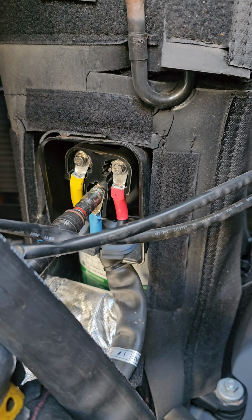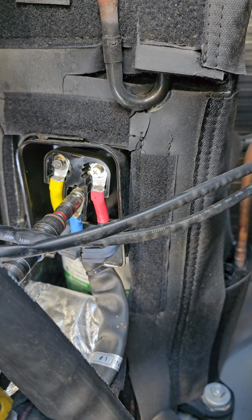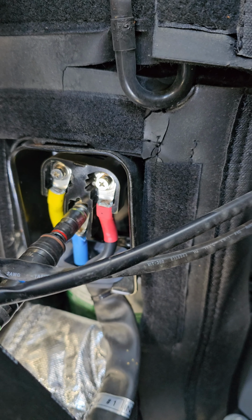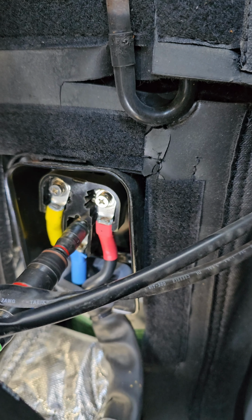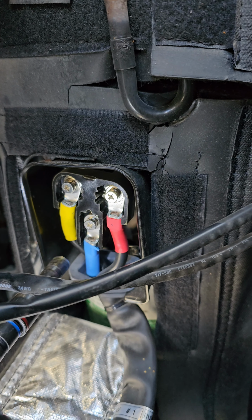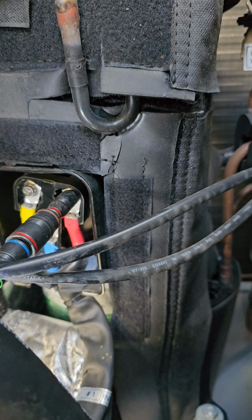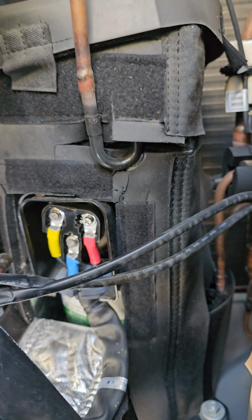Now if you're going to use your impact driver to put this thing in, if this thing is impacting from the get-go, that means you have cross-threaded. You gotta be careful not to cross-thread it. And then when you get to the end, and it don't go crazy, just squeeze a little bit, like you see that I just did, just to make sure you're snug. If you don't know what you're doing, use a screwdriver.